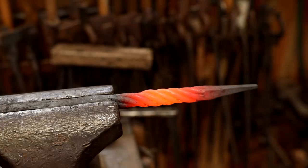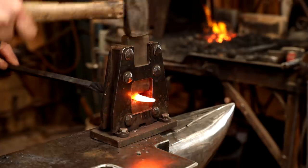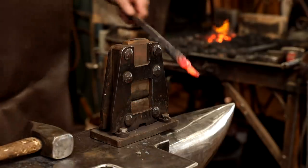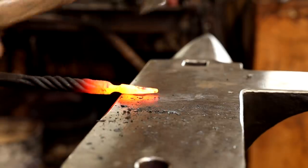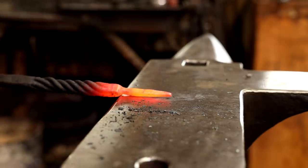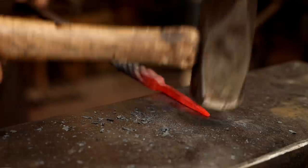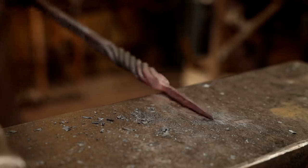Although this looks good just the way it is, so you could leave it. I'm going to use the guillotine tool and pull it in just a little bit here — square, octagon, round. I'll draw this out so it's all about the same size and it gives me a nice transition. Now remember this is forge welded, so that very tip is six different pieces of material drawn out that small — so it's a good forge weld.